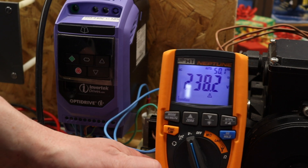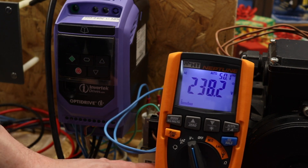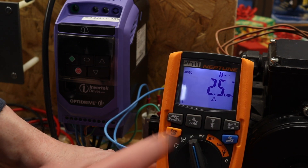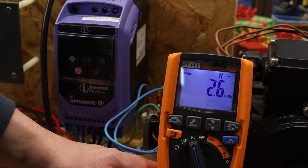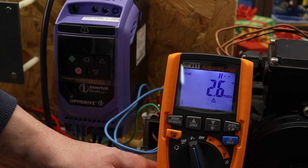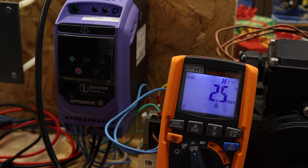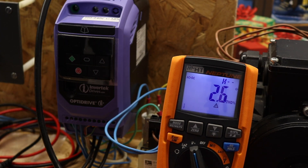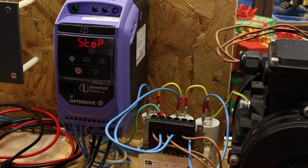Switching to the actual mains, we've got 238.5 volts — pretty standard for the UK. Going to harmonics, all I've got is 2.5 percent total harmonic distortion. You can see just how rough the output of these inverters is in comparison to normal mains. But there is instrumentation out there that can do the job — so I'm not really sure what Megger's problem is with their unit.